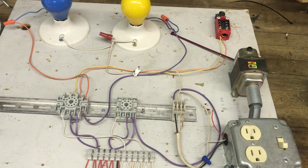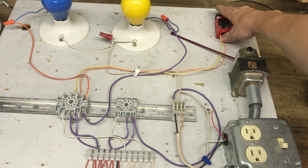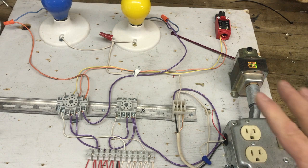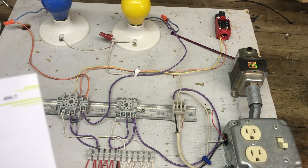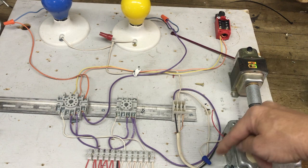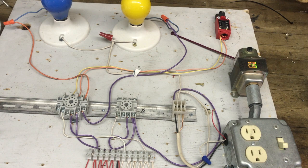What I'm using for an external switch is a limit switch, engaged by a rolling switch. Following the yellow and orange wires back, they go to pins five and six on the base, just as the diagram shows. My setup has one circuit for normally open timed open and one for normally closed timed closed, running at 120 volts — I'm not using the 24 volt option. I have a 120 volt bus, neutral bus, switch legs, and the external switch.